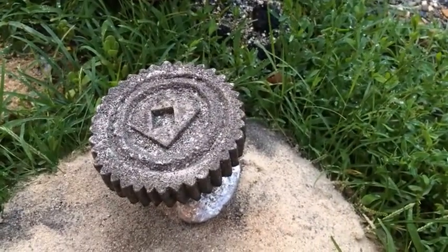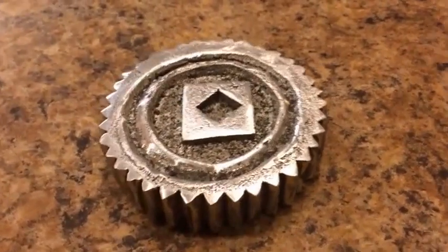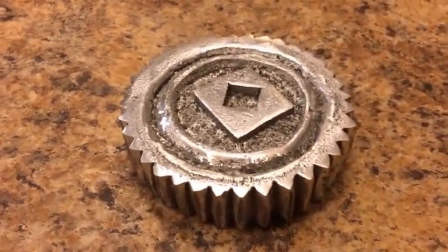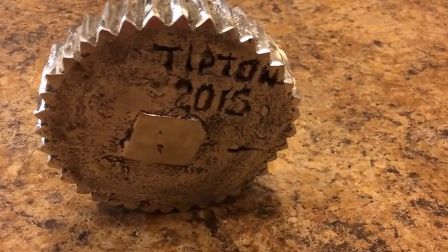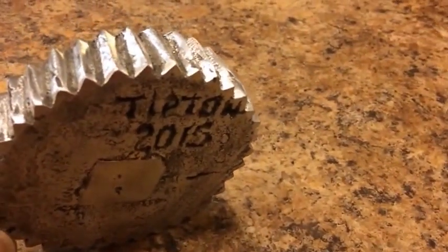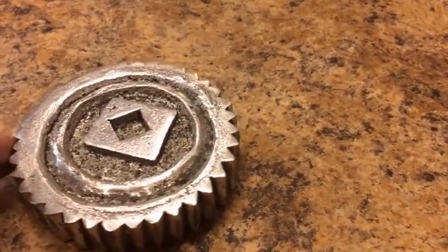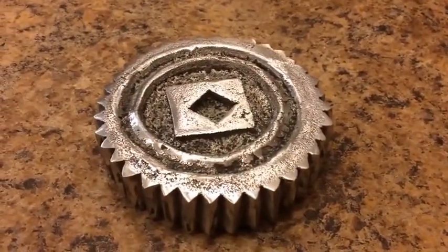Let me clean it up a little bit and we'll see how it turned out. And there's the finished product. There is a piece of cast aluminum that I cast in my own foundry. There's where the sprue was — I didn't quite get it cleaned up. All I've done is wash it up to get the black residue from the foam off, and then hit it on the buffing wheel a little bit. But that's the way it came out — looks pretty good. Thanks for watching, bye-bye.